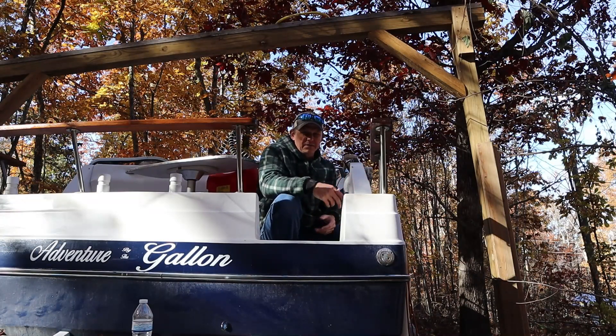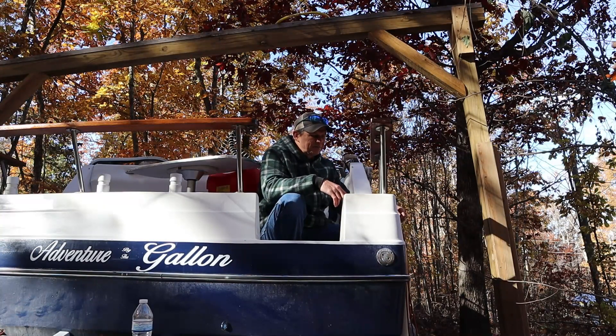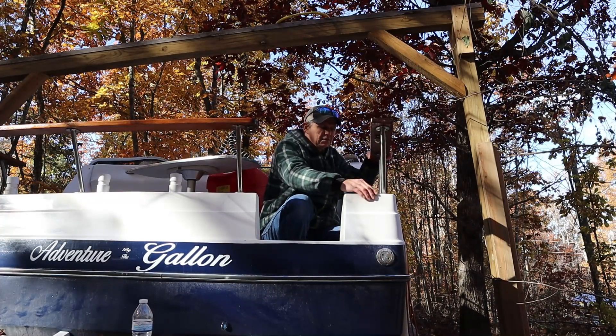When I took these off, I epoxied over all the old holes and re-drilled them when I put the bolts in. I put more than double the size screws in and most of those sides it worked, but for this one here I don't know why it did not grab anything. That's why I pulled all the batteries — I was trying to get up underneath. Luckily we can get to it from this vent, so we're going to be able to put some bolts in. Definitely got to get this secured back down because that moving around is no good.